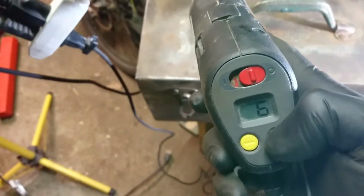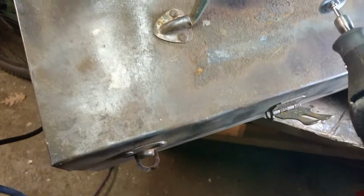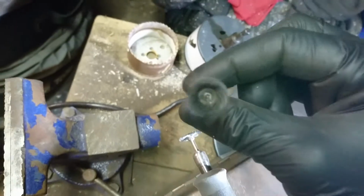Alright, got the wire brush on the Dremel. Gonna set it to, say, 21,000 RPM. And gonna hack away at some of the spots I missed. I actually think that this bit might be superior. Be able to cover more surface instead of just the small side like I'm using. We get to use this much surface area. Swapped out. Let's see what we can do.